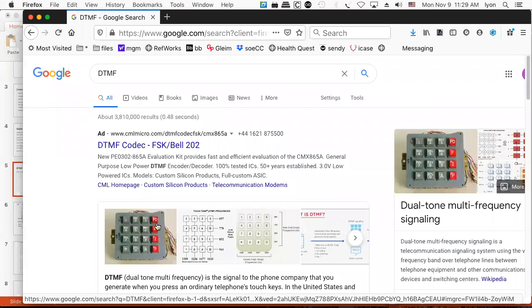And if each one of the keys are equiprobable, then you actually do have a 4x4 matrix, which means 16 different symbols. So I could take essentially log to the base 2 of 16 and get a number, which would be like 5, I guess. Right, because, well, is it 4? 2 to the 4 is 2 times 2 is 4 times 2 is 8 times 2. Yeah, 2 to the 4, sorry. So that would be like 4 bits per symbol if I use these numbers and each one was equiprobable, and I could encode my digital data in that way.